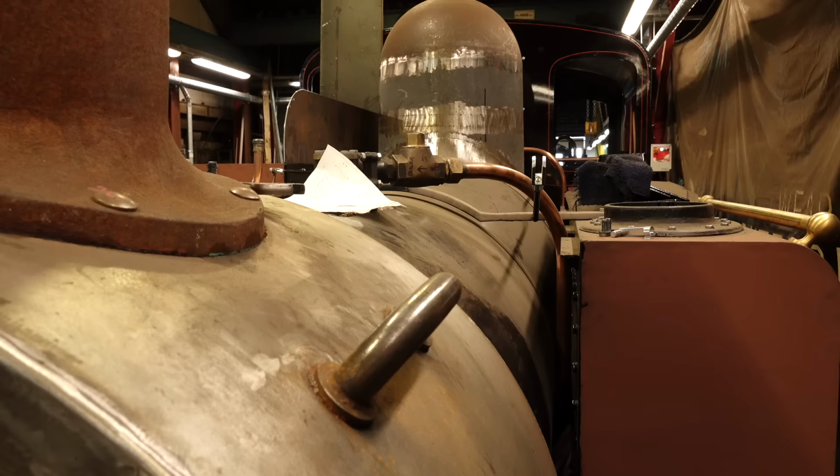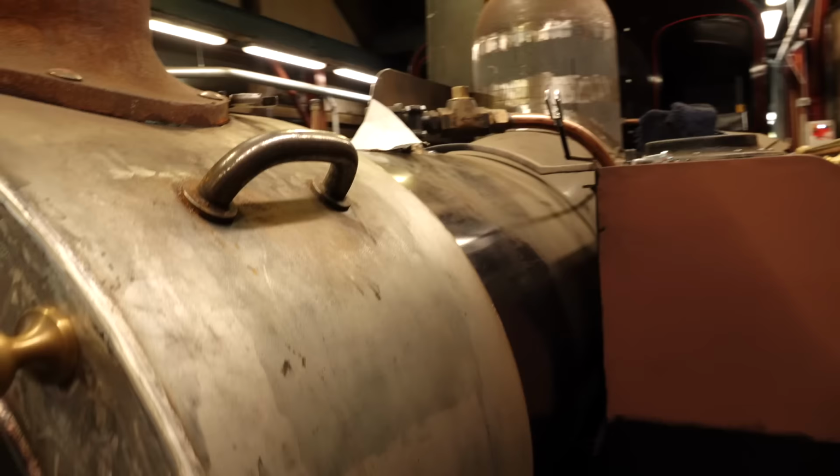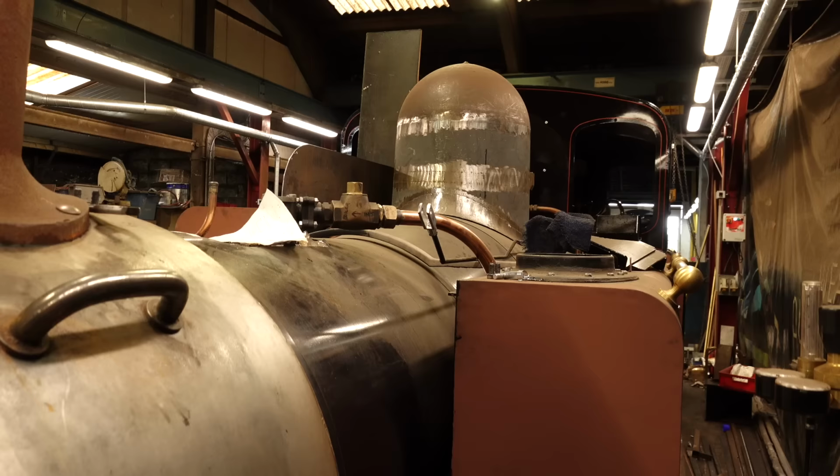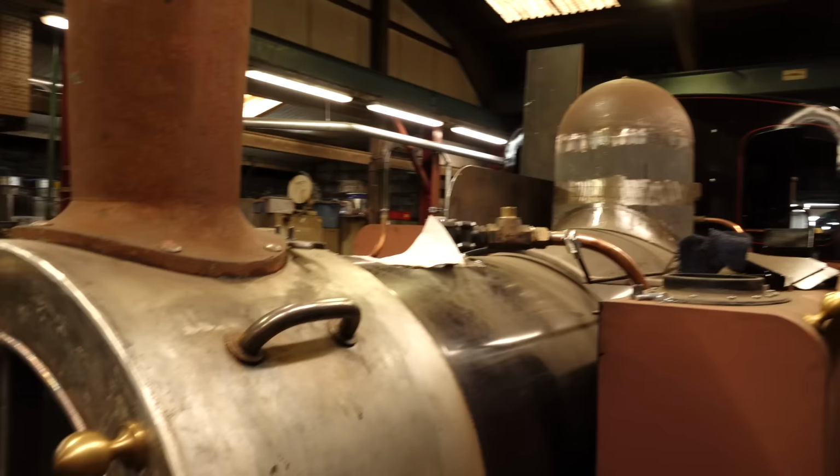Bob's doing the ejector exhaust. Lots of details like that are being worked on at the moment. The injector on the driver's side is in the cab behind, and then the delivery comes up and into the clack valve, that non-return valve there, and then it's delivered into the boiler in the top. It's delivered in the top so that the steam and water go into the steam space, and any oxygen that's dissolved in the feed water flashes off into steam straight away, hopefully, rather than if it was injected under the water level, when it would be more likely to stay dissolved in the water. And we have trouble with boiler corrosion, so